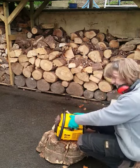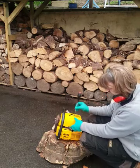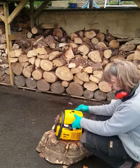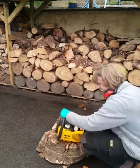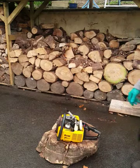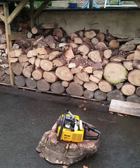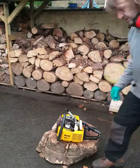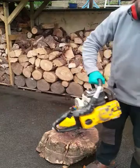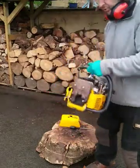a really late Swedish equivalent of something of this size of saw, they're still less than 5 kilowatts, so they're only, I think they're 4.9 kilowatts, and so in the space of 40 years it's only 2/3 of a horsepower difference. And something like the 395 will run a 28-inch bar, whereas Partners say that on this size of saw you could run anything up to a 36-inch bar, so a 3-foot, so a real big lumber saw.